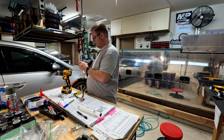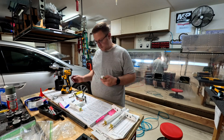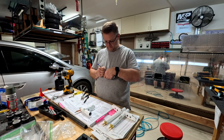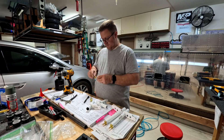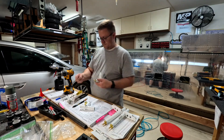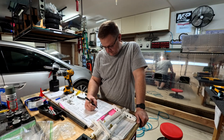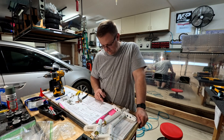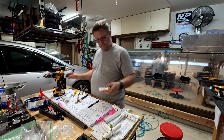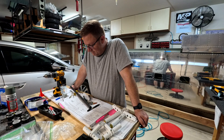You need to make sure you get all the gunk out of them, then put the threaded ends on just like you've done for the four other push rods. Then there's a big steel bar that goes in between the two ends — that's kind of how they hook together. I made the mistake of priming it, and the primer got in the way because the tolerances between the tubes and the steel bar are very very tight. When I tried to put it in, it would scrape off the primer. That was not fun.